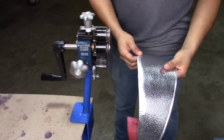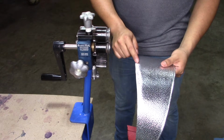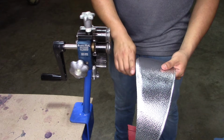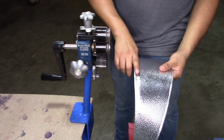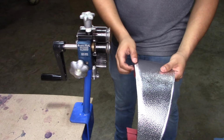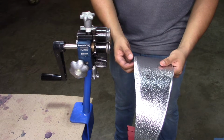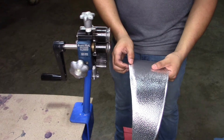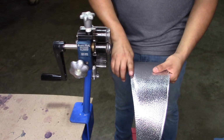Also, one thing I forgot to mention, make sure that you only crimp 1/2 inch, because the other gore is going to sit on top of here and you don't want to crimp too much. That's why we only gave it an extra inch. So it could be 1/2 inch of the bead and 1/2 inch for a crimp. That way it can go over the other one.